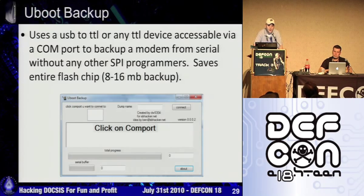The reason for all the security holes still existing is that they're still allowing DOCSIS 1.0 modems on their networks. DOCSIS 1.0 had no way to verify that — all it has is BPI, which encrypts your traffic, but it did not have BPI+ which verifies the MAC and serial number to the certificate. Comcast has tried to get rid of all the 1.0 modems but there are still holes, and the rest of the ISPs just don't want to spend the money to replace all these modems with DOCSIS 2 or 3.